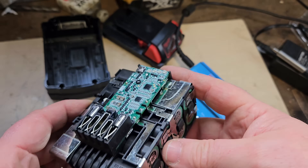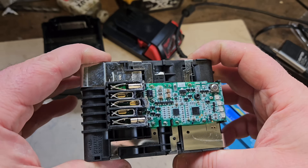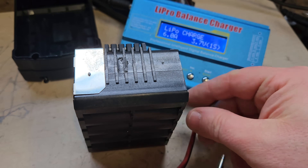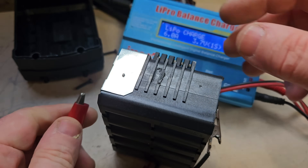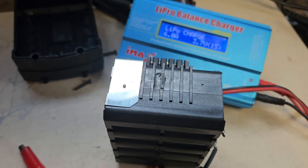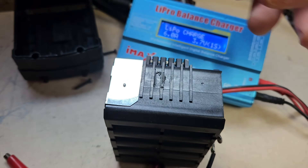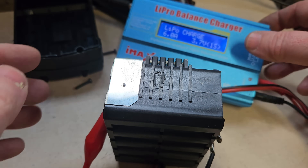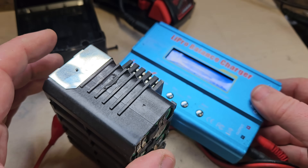However, I have a load tester today. I'm going to bring this up to fully charged, make sure it's right and the charger and the board are alright, and then we can do a load test. I'm going to attach these on my small magnets here. There is a risk of cross-connection if you don't know what you're doing, so be very careful if you're attempting this yourself. You have to know what you're up to, and you have to know how to set the charger as well. Make sure everything's sitting in place where it should be.